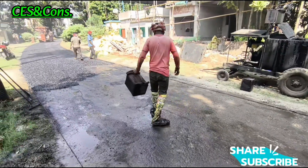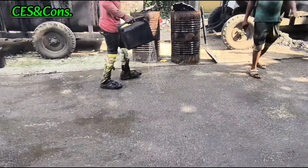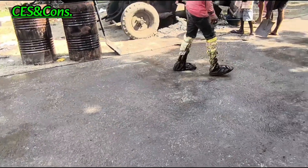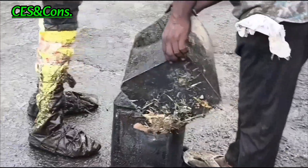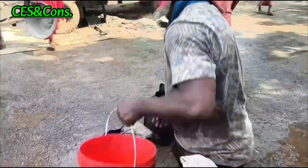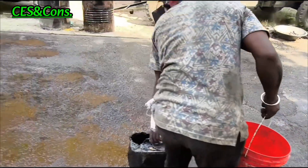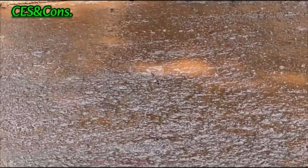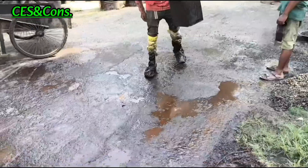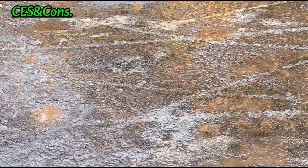This is sprinkling of water to make the surface damp prior to application of cationic bitumen emulsion as tack coat. The water should never be stagnant on the surface — it is to be damped only. This is the application of cationic bitumen emulsion rapid setting grade 1 as tack coat, prior to laying mixed stone materials, as per MORTH clause 503/2. The quantity should be 0.2 to 0.3 kg per m² — on average 0.25 kg per m² — as per clause 503/4/3, table 500/3.